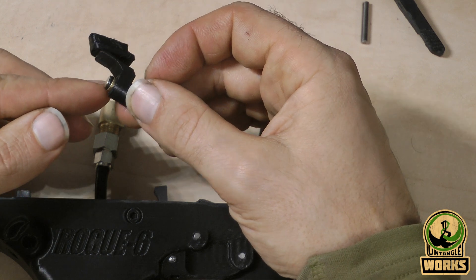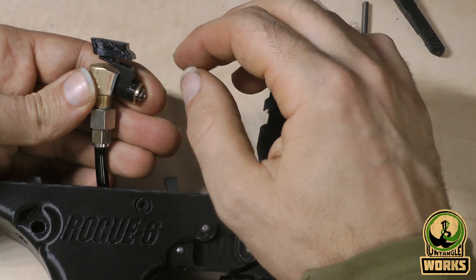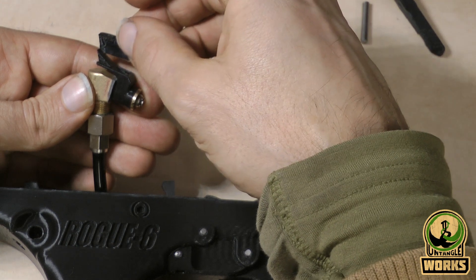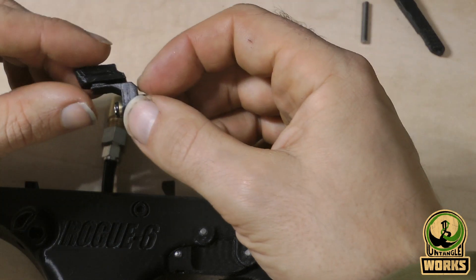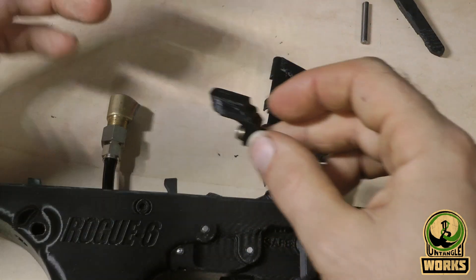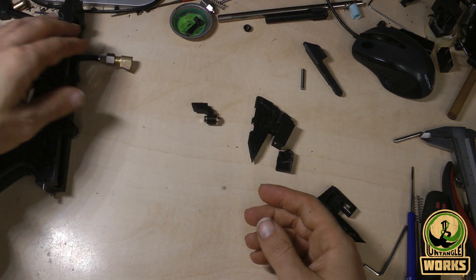What I want to do is put some silicone right here around there, carefully to not put it around this piece because it needs to be moving. Then press it against that. While I'm at it, I will also do it around this edge right here around the TPU, just to give that a good seal as well. As you notice, this is quite delicate, so be careful with it when you handle this. It is best to install it like this where you can support the underside, and then take this as one unit and place it on there. As long as it is installed it is fine, but there is not much room to work with. The hose and fittings section is all fine — that is just normal fittings and will not leak, as already tested.